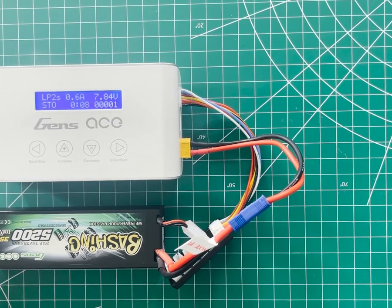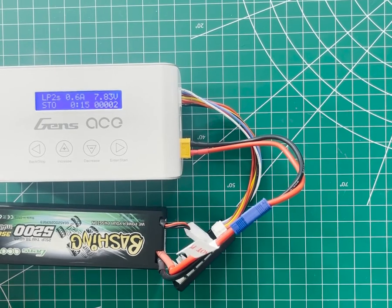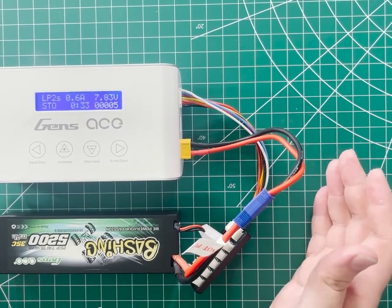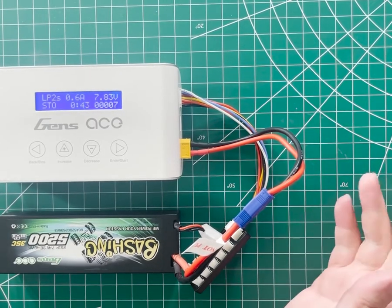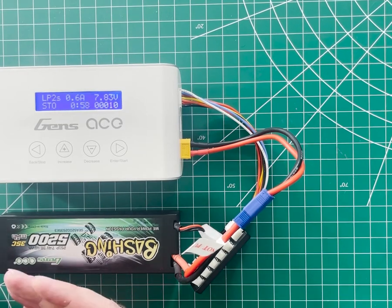Pretty much all LiPo chargers will stop charging on their own, but you don't want to leave them plugged in when they're done charging. When a battery is plugged into something, there's a little bit of a drain on it, and we don't want these to drain too far. So unplug it from the charger when it's not in use, the same way you'd unplug it from a car, boat, or aircraft. If you're mindful of all of these things, it's unlikely you'll have issues with your batteries. That said, LiPo batteries can rarely be a serious fire hazard. You should ideally be charging in a designated area where a possible fire can't easily spread. Never let a battery charge unattended. The best thing you can do is pick up a fireproof bag or box to charge and store your lithium batteries in. Links to some of these options are in the description.